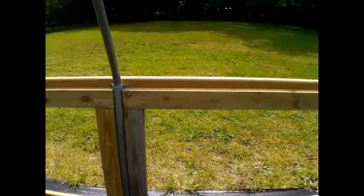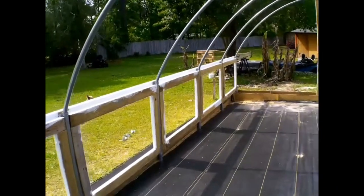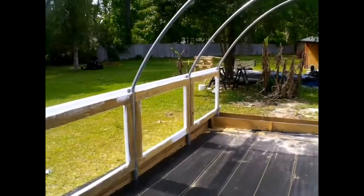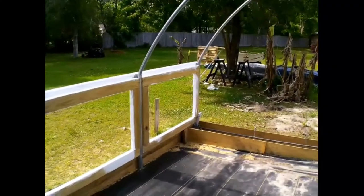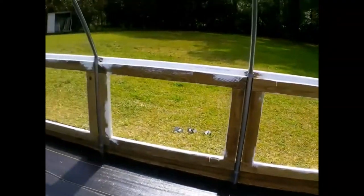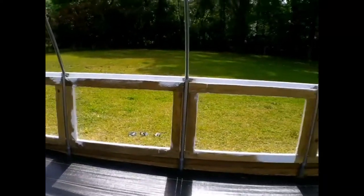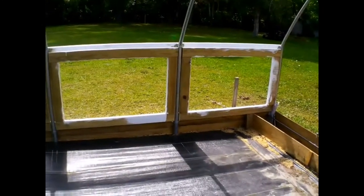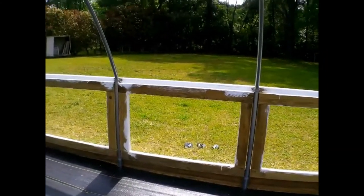It would make it a lot easier, but this greenhouse, you're supposed to square it off. That's why I hired him. I wanted it square. Once you get it square, everything should flow. It's just like a house. But when I started cutting these boards, nothing was square. Everything was out of alignment. So I totally had to redo this whole entire wall right here. Take it apart, take it down, put new boards up. And then I cut my 2x4s to frame in for that hardware wire.